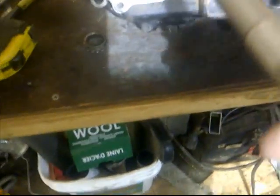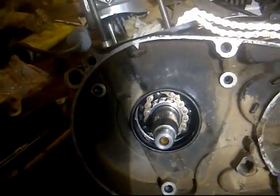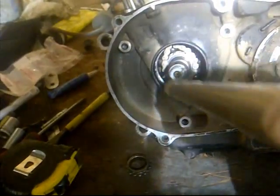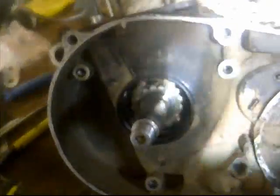Reinstallation of that gear — of course you have to line up one of your teeth with the keyway right here. If you look at the keyway, you'll notice that I do have the one tooth lined up, and that is imperative for the motor to work properly. Reinstall was done with this brass punch here on the gear — I just basically went around it nice and easy and it pressed right back on there, no problem.